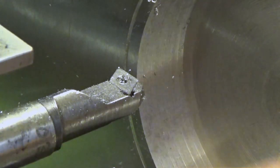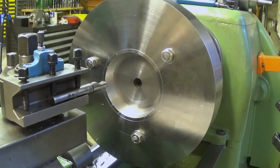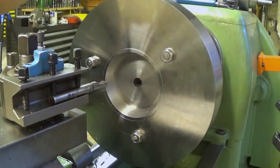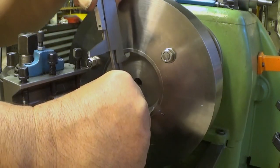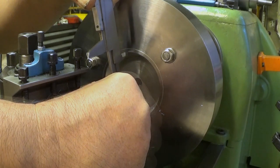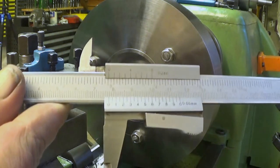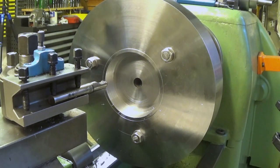We should now be here at 76.77. I would never ever use this caliper to measure the final dimension. Actually, I cannot measure it because of the taper. But this is just a sanity check. Okay, 76.77. Well, it's 76.6, but of course this might lie to me, but near enough. Now, that was the first 6 millimeters.